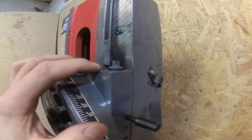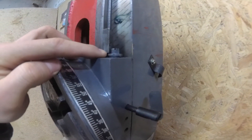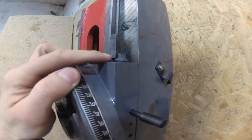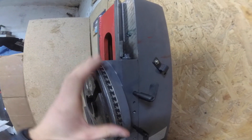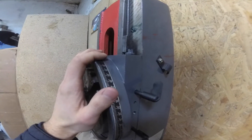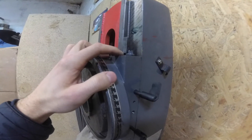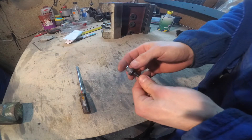I think it is because in the factory they roughly made this hole here, this space bigger than the head of this screw. So I will need to prepare some shims and apply one or two there to somehow eliminate this gap. Because every time I am moving the head mount, it will be loosened a little bit, so when I go down or up the clamping force will be different each time. Anyway, it is bad.